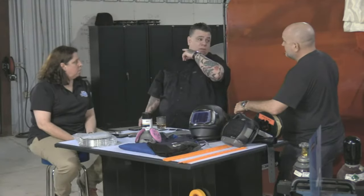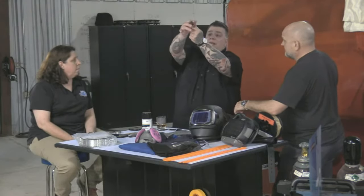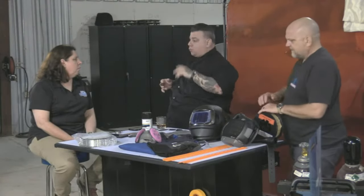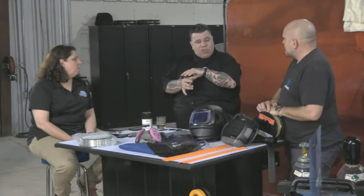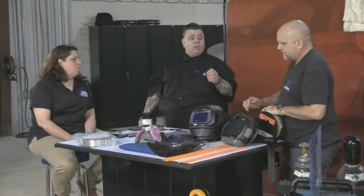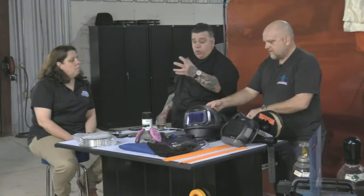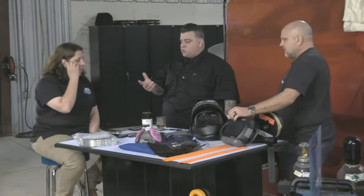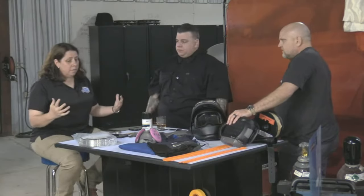And guys will know this, when you do the 300 millimeter overhead weld, that's 12 inches, and I'm welding like this, pulling towards myself, this right here gets super hot. Halfway through, you can't weld anymore. So unless you have a thicker glove on, the radiant heat that comes off an aluminum panel is ridiculous. You don't get it with steel, so you can wear thinner gloves, which give you a lot of dexterity in your fingers. With the TIG welding glove on, you don't have as much dexterity, but you're only holding a half-inch piece of metal. Gloves. Buy them, wear them.